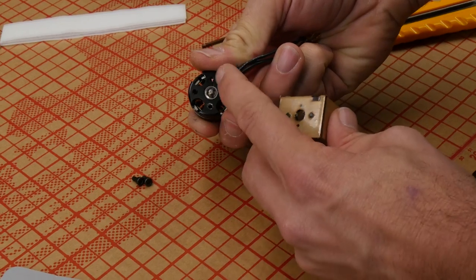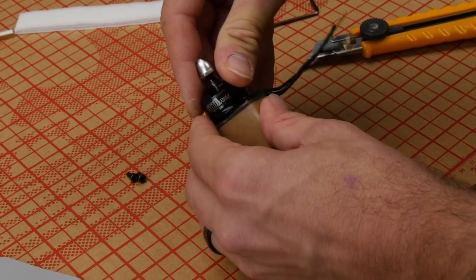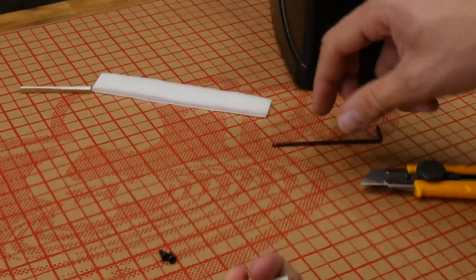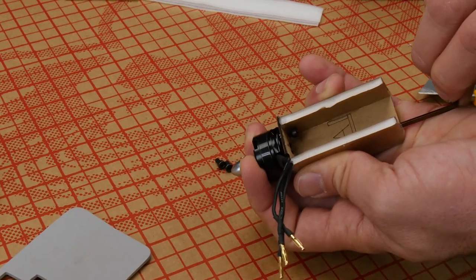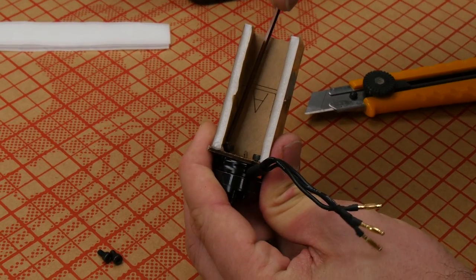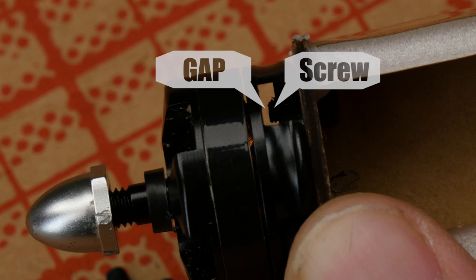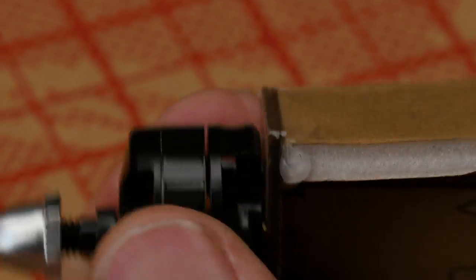The motor has two spacings — a short width of 16 millimeters and a long width of 19 millimeters. We're going to focus on the 16 millimeter portion, wiggling it around until it centers up right over those screws. We're going to go back and forth just a half turn at a time until we feel both screws engaging. We don't want to lift our motor off the firewall — we want the screw to engage the back of the motor and thread it nice and even. Inspect the gap every couple turns to make sure the threads don't get close to the windings. Do this on every motor you install — quadcopters, planes, anything. Make sure those screws are not too long.